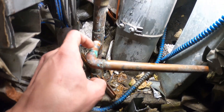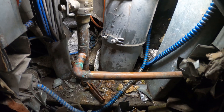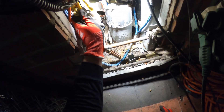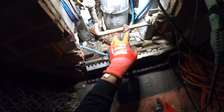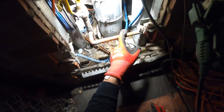This elbow needs to go. Let's cut here, unsolder from here, pull this out, and rebuild it. They shut the water off from downstairs — clearly it's not leaking anymore. This is open but the water's coming from downstairs and going up, and I believe this feeds an irrigation system somewhere on their patio.